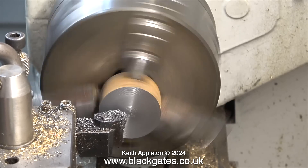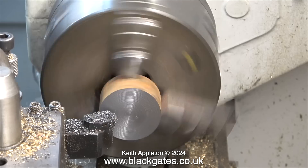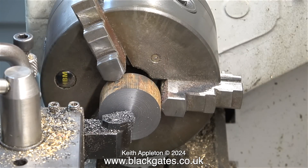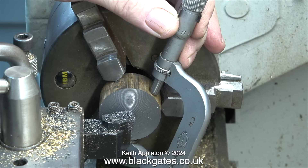It's good for a learning curve anyway. I need to face across the front of the piece and make it nice and flat and smooth. The final finish will be obtained in my larger lathe with everything mounted in a collet chuck. This is the front of the piston which will be machined away considerably, so it really doesn't matter if there are some rings in it. What is important is that this piston must not under any circumstances be machined to the finished diameter at this stage. Using a two inch micrometer to measure the original piston, you can see how much bigger the blank is than the finished piston — that's okay and exactly as it needs to be.